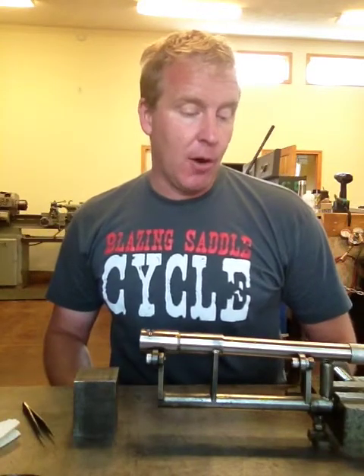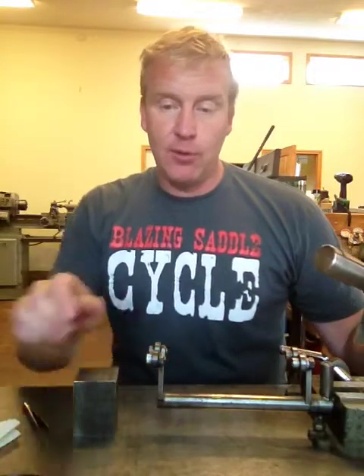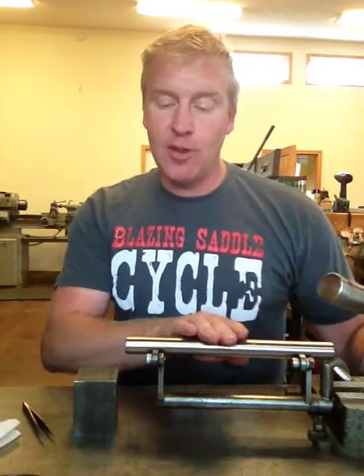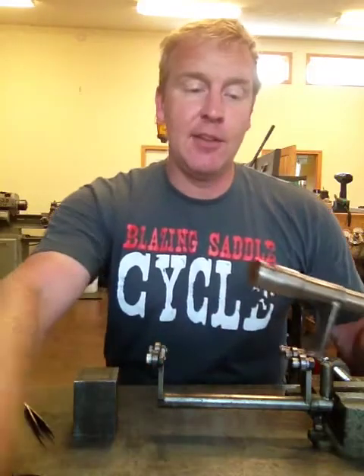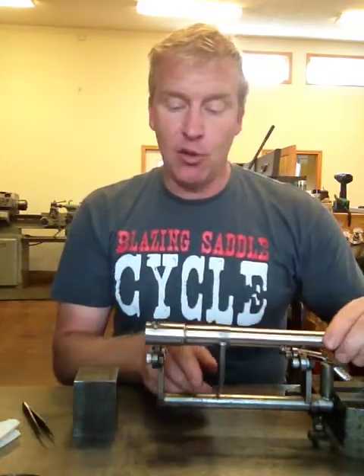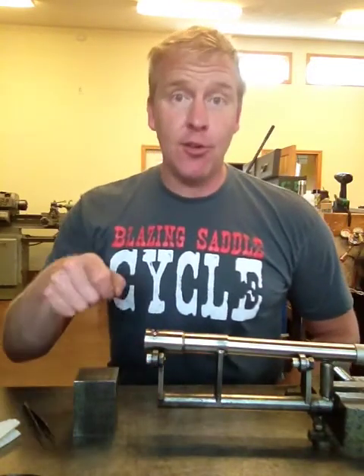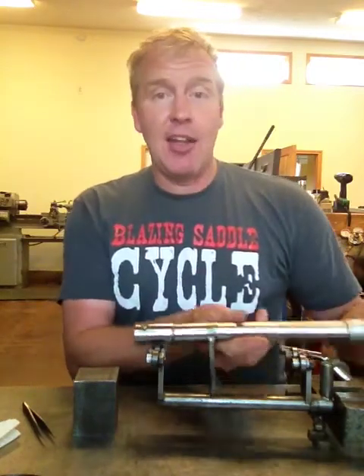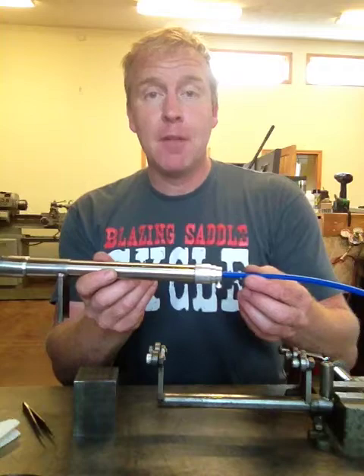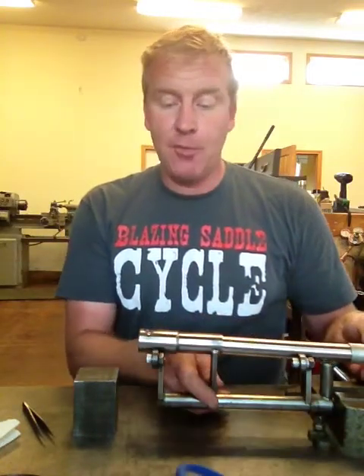The way I accomplish this is I made a little fixture here that's two part. The first part is a little rolling fixture that allows me to rotate the piece while it's on. The second is a small chamber that holds the entire grip section in it as well as the cap. It's slotted on top to allow me to insert the piece into it, and then I have that attached through some tubing to allow me to purge the inside, escaping through the upper hole as well as from the outside.